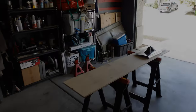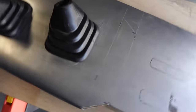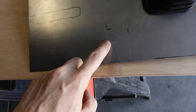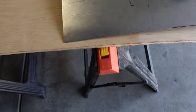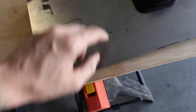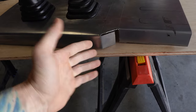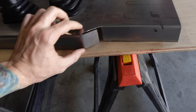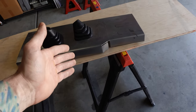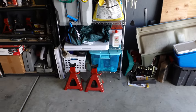It's the next day, and looking at this thing I'm not sure if there's a better way to handle this. I basically have to cut out this triangle here in order to fold it the same way on the other side. I was thinking I could cut this a bit longer to fill that void, but that would make this other area shorter, so either way there's not enough material to perfectly fill in that void. If you know a better way to do this, please let me know. In the meantime I'm just going to fill it with weld or body filler.